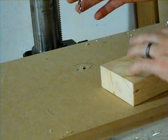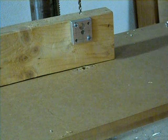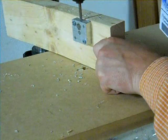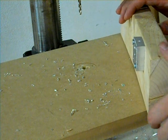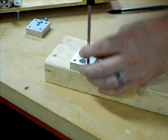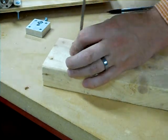I have a 3/16th inch bit and my block with the aluminum screwed to it, so I just have to drill through the side now. And that's actually pretty easy as long as you have it screwed down to a board — if not, it's dangerous. It's essentially done now. I can take it off the board, and this is the easy way because there's no tapping involved — it's all just regular drilling.